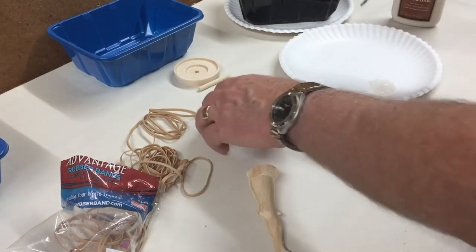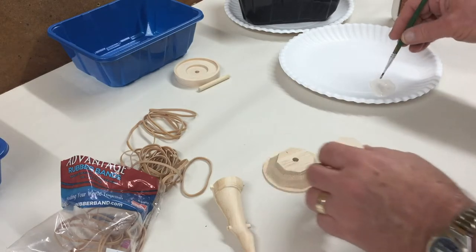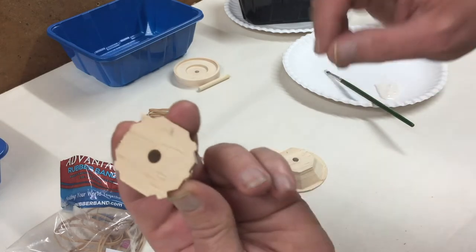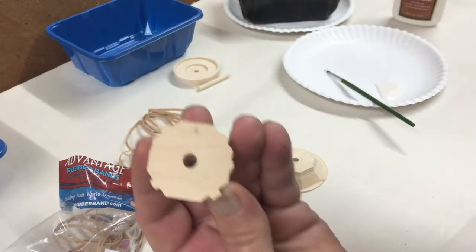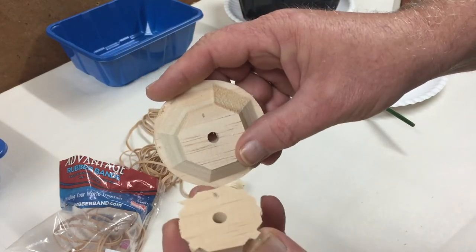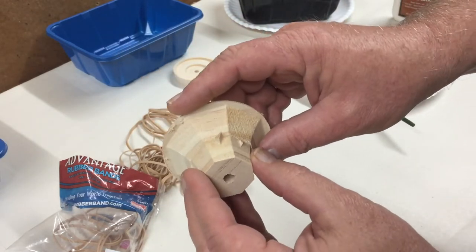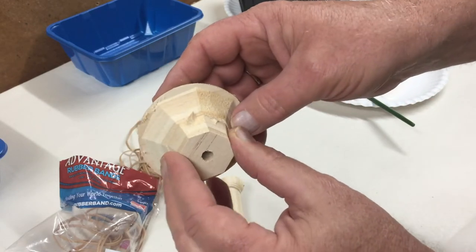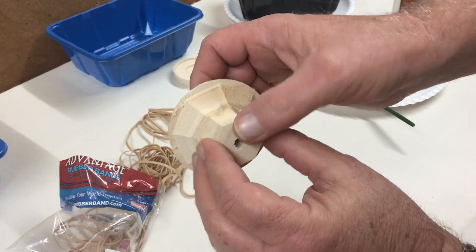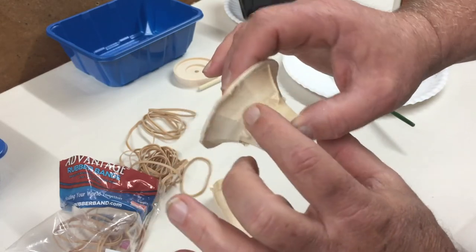In the meantime, I'm going to go ahead and glue together the lampshade parts — the top lampshade part and the bottom. Now you see how I've marked — I put a little mark right here and I've also put a corresponding mark right here. The reason I did that is so that it matches up with the grain of the wood that I cut it out of. So as soon as I separated these from the boards, I kept track of the orientation and just made a mark there so the grain pattern matches up.